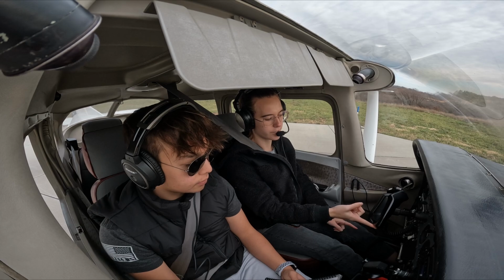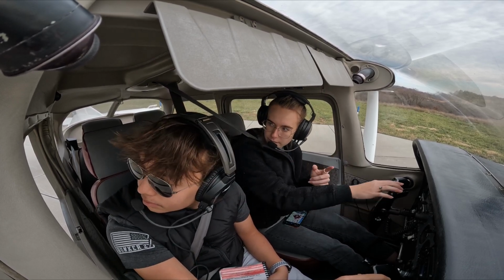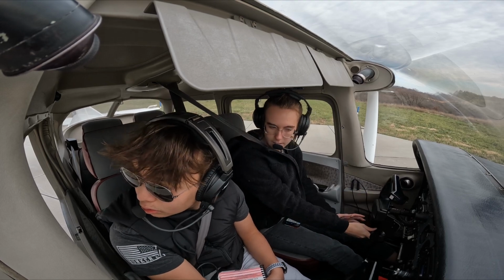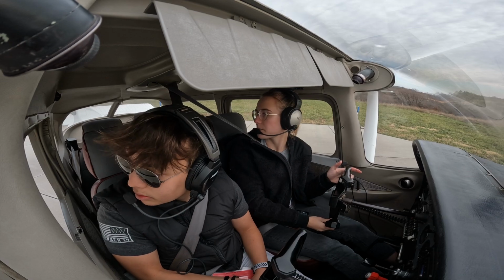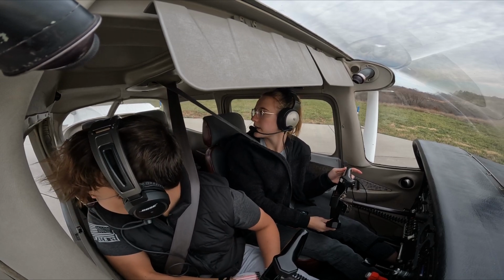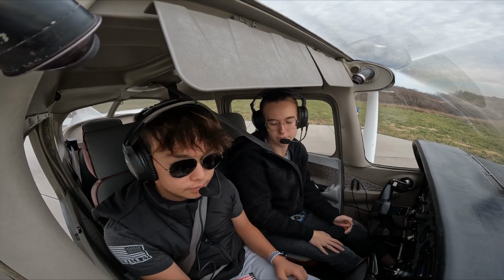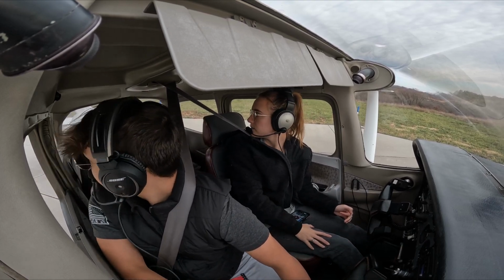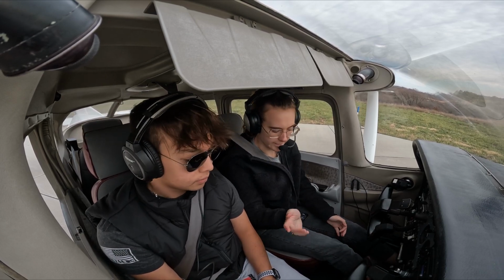So what you're going to do is turn it all the way one way. Look, that one's up. That one's down. And then you turn it the opposite. That one's up. Yep. That one's down. And then while it's still turned, lift up the back, look behind you at the elevator. You see it's up. And then push it down and it goes down. And then do your rudder pedals. So full right and full left. So check to see if the rudder's moving. I see it on my side, and then you see it on your side, right? Yep. So full deflection, and that's you check your flight controls.